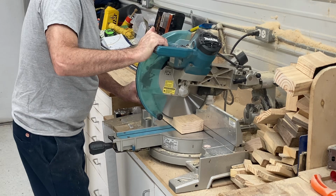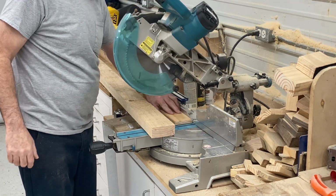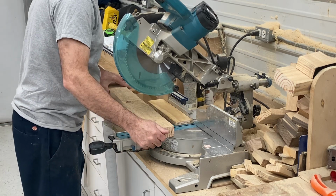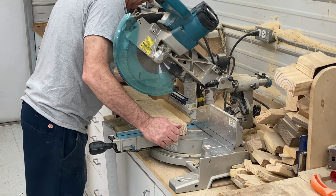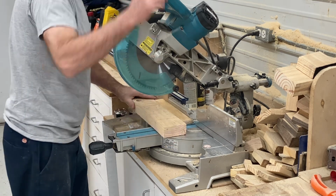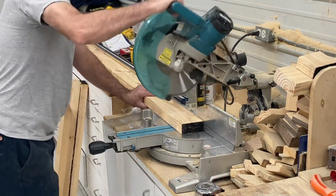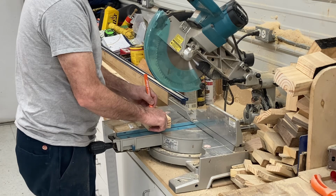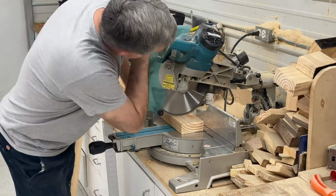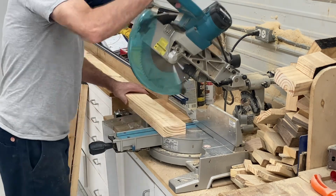The doors that I'm building are about 9'6" tall, and they're 92 inches wide, so just a little under 8 foot. There's 4 of them. They overlap on the building about 3.5 inches, and then they overlap each other about 3.5 inches, with the exception of the very center, and the 2 center ones just butt into each other head to head.